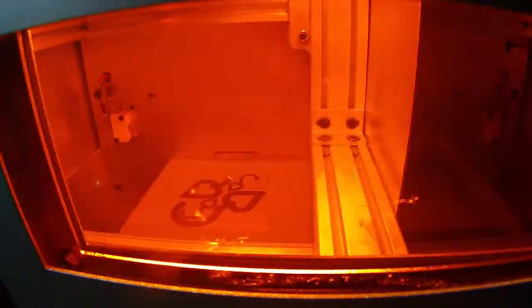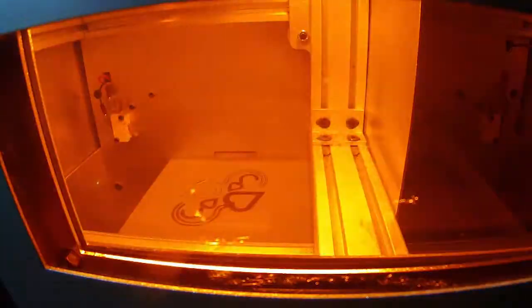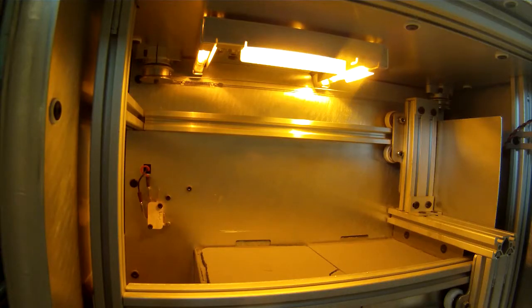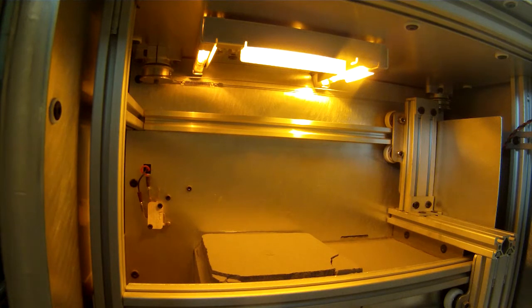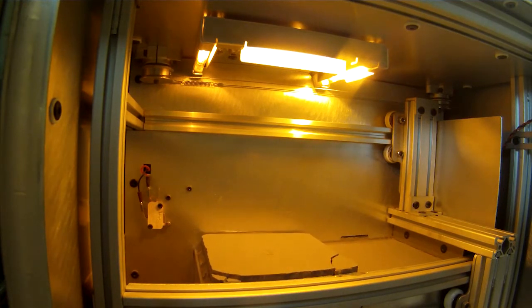That laser line does have a thickness, so you need to factor in the laser thickness and have an offset. If you double or triple the perimeters, you have to compensate for that thickness. You don't want it to overlap too much, but you also don't want it so spaced out that it doesn't help. If you're using 80% or 100% old powder, you need to change the laser parameters — there's just no way to sinter it without major issues using the standard parameters.